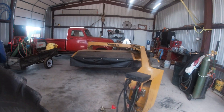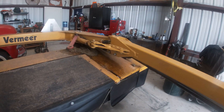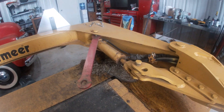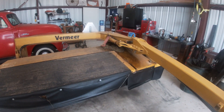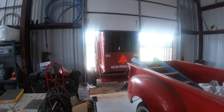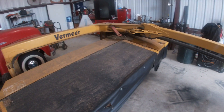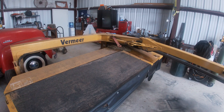I got to do some work on this thing. I was cutting with it and you can see I got a little hydraulic leak, but this cylinder - the packing is blown. It quit operating. This thing is supposed to swing out and it quit doing it the other day when I was cutting on the last 20-acre field I was making hay on. My priority is to get this fixed because we got rain coming over the next three days.